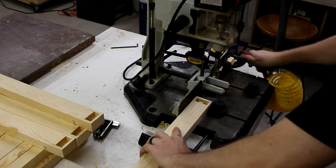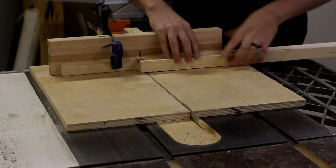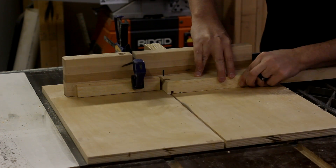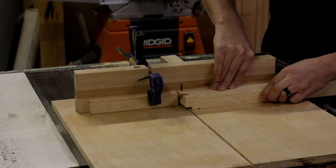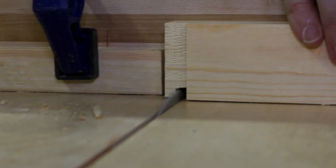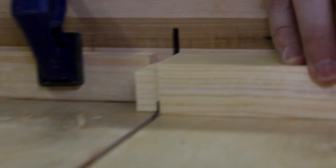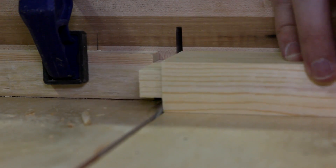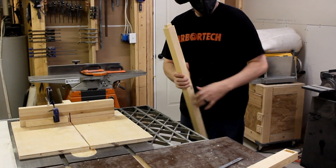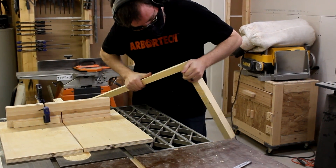It may not be nearly as impressive, but hey, if I wanted to impress you, I'd just show you my entire collection of Golden Girls episodes on VHS. And now to cut the tenons, I just raised the blade exactly one quarter inch up and trimmed all four sides. This made it real quick and easy to cut all my tenons, since they all had the same shoulder depth. Giving it a test fit — perfect.